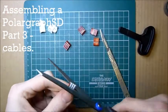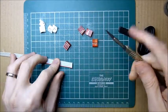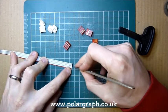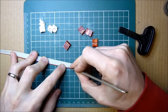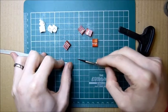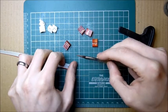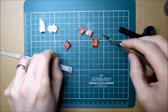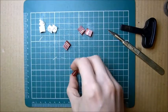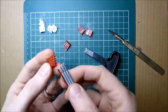Making up some motor cables here. Cut the ends of the cables square, cut a bit of insulation off them. These are four-way cables because the motors should be able to carry a fair bit of current, which is why these are thicker than your average ribbon cables. So we'll use the proper little connector - these are IDC connections, they fit in like so.